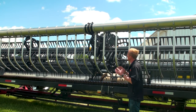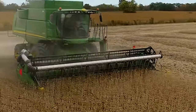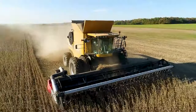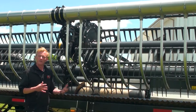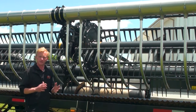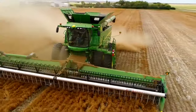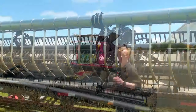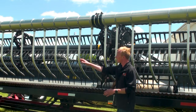Depending on header model, the AWS AirBar either uses a one or two manifold design. Headers designed with a single reel receive a one-piece manifold system, which is structurally stronger than a multi-piece bolt together design. On single 35-foot manifolds and longer, a cable truss system is utilized to further reduce pipe deflection. Larger split reel headers utilize a two-piece manifold design with a flexible coupler in the center, allowing each manifold to independently move with the reel. Both manifold designs utilize an internal baffle, equalizing nozzle airflow across the length of the head.